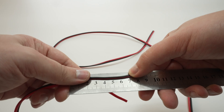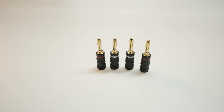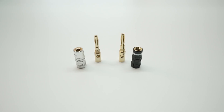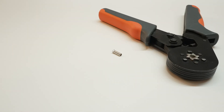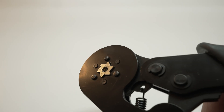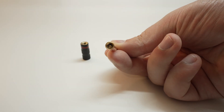Just cut the wire to length and at the end you want to separate the two conductors for 75mm — try to be precise about this number. To go along with the wire, I chose these banana plugs, which underneath look identical compared to the Nakamichi, just measuring slightly worse on resistance. However, they are noticeably cheaper. Since this is a thinner wire, I want to use a ferrule to make the conductor a little thicker and to minimize oxidation. Ideally you want to use a 6-sided ferrule since the wire will be inserted into round spaces.